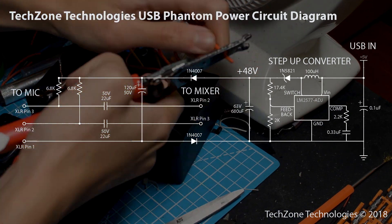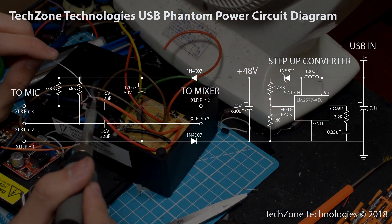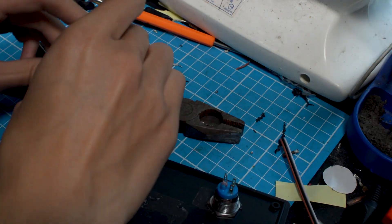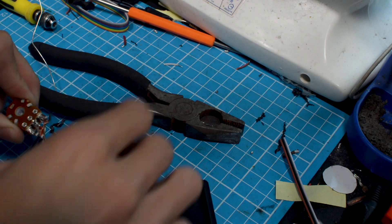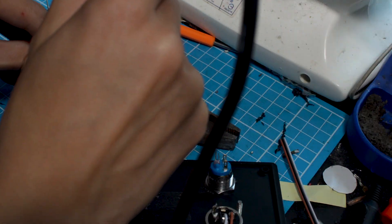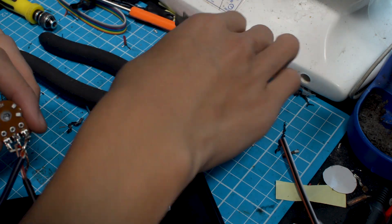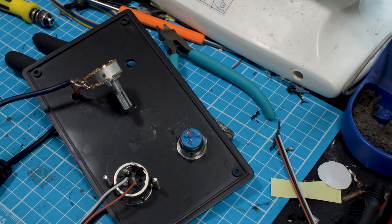The last step is to add a headphone jack to the device so the audio can be monitored with low latency. The headphone jack will be soldered to a 100kΩ dual potentiometer. The other section should be soldered to the male and female ports of the 3.5mm headphone jack. Then the headphone jack should be connected to the headphone ports on the Audio-Technica audio adapter.